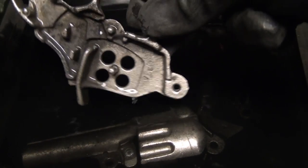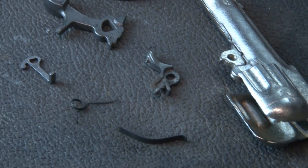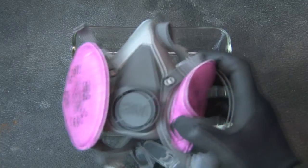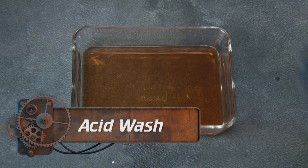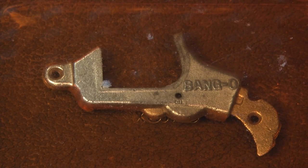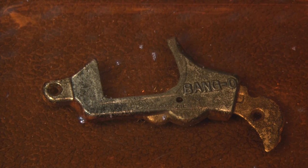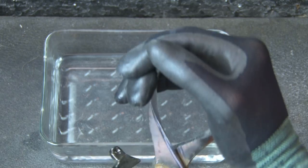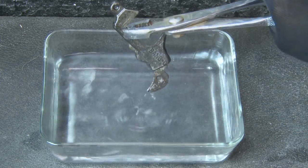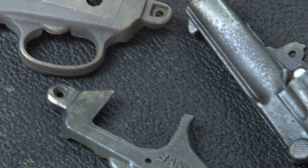The vast majority of rust has been killed. Now I'll use my wire brush attachment on the Dremel just to get any additional surface rust off. All the parts are now clean, but now we have a major task that requires protective gloves and a respirator. I'm going to be using Liquid Fire. This is basically sulfuric acid that's used to clear drains. The major components of this Bang-O cap pistol are nickel plated, and in order to restore it with nickel, the old plating has to come off, which I'll do by burning it off. This process took a while and I needed to monitor it because I didn't want to etch off any of that cast iron. After about 45 minutes, the components were removed from the sulfuric acid, giving it a quick water rinse, and sure enough, that nickel plating is gone. To make sure I had a completely gunk-free surface, I gave everything a good rub down with some Scotch-Brite. All the parts are cleaned and looking good. Now it's time for the next step: electroplating.